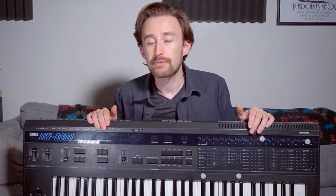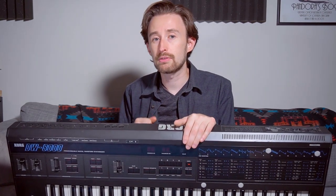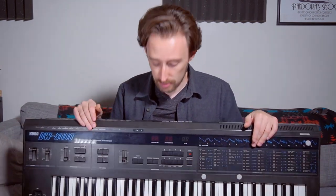It's also a lot more affordable than most vintage polyphonic synthesizers. I think I bought this one on Craigslist for about $150, and a lot of times what happens is that the battery will die on these units, and because the battery is hard connected to the main circuit board, people think that, oh, the whole synthesizer is broken. But all you have to do is pop off the bottom case and spend a couple minutes desoldering the terminals, pop on a new one, and you're good to go. So it's a great way to get in cheap into vintage synths, especially polyphonic ones.